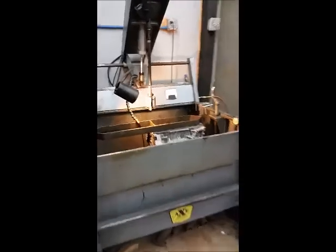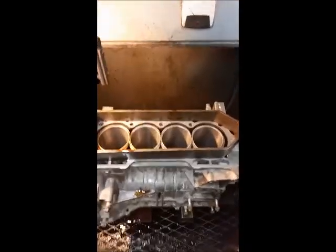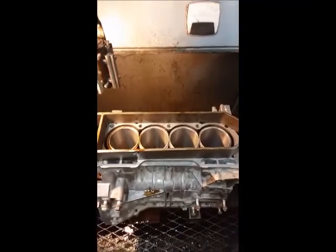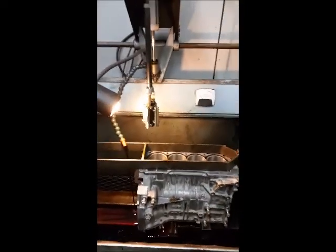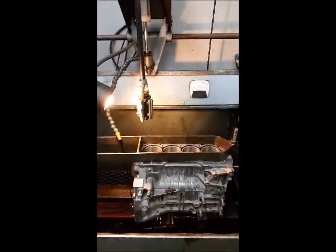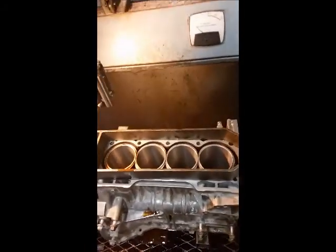It's time for the Honda block - all four cylinders have been bored and they're ready to be honed. We're over here at the honing machine, this is an Axe Equipment cylinder hone that uses stones and shoes and a honing fixture. It's powered but it is a manual machine, so you have to manually stroke up and down, but it does a great job getting really true, accurate cylinders.